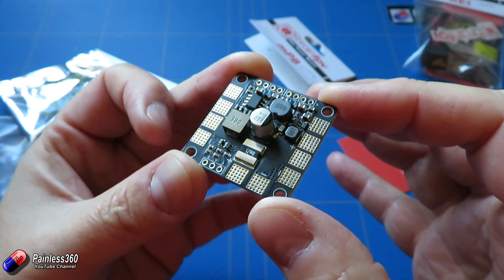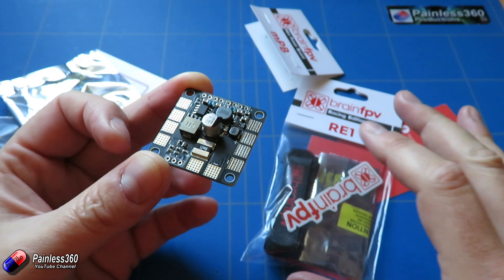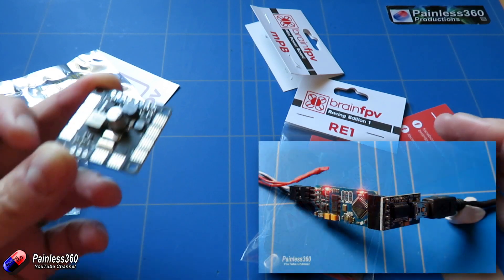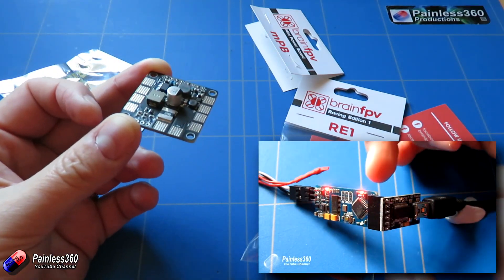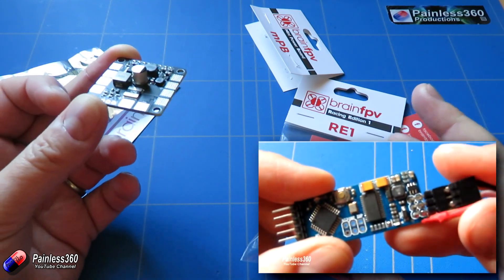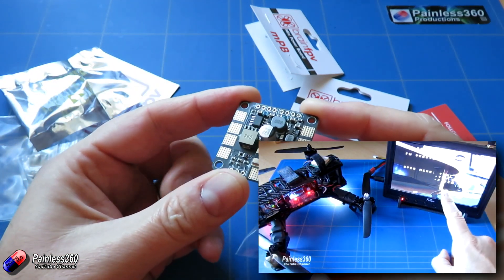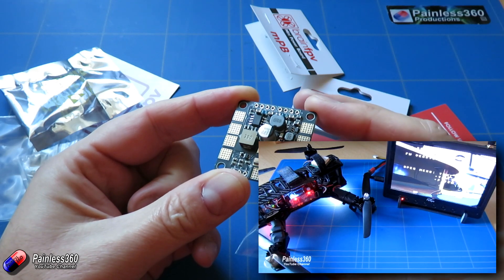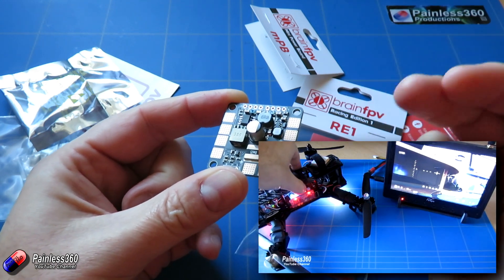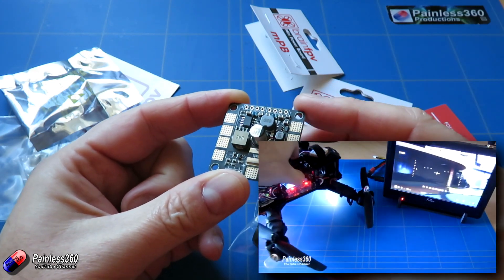The other big difference with these two bits of kit is the on-screen display. This also includes an OSD, and it is not based on the Minim OSD. We've had lots of videos about the Minim OSD — we've added it to NAZE 32s, APMs, CC3Ds, Seriously Pro F3s, and more. The way that technology works is a little chip interprets the telemetry data from the flight controller, then using a MAX chip overlays alphanumeric characters in the positions you've chosen on screen to show things like heading, milliamp power ratings, and battery voltage.